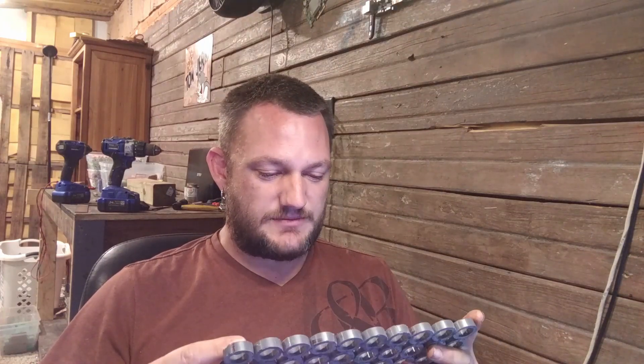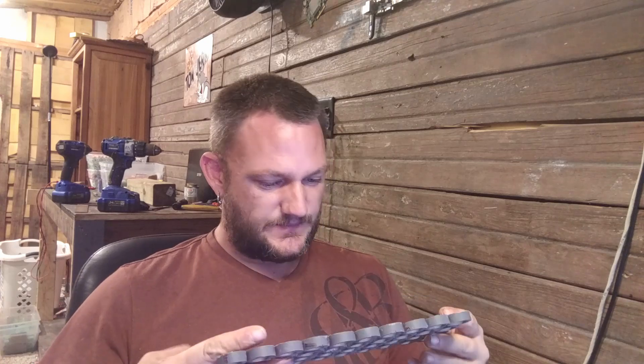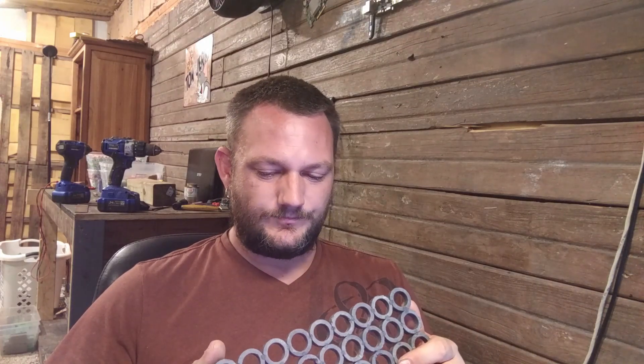Overall quality sucks. Maybe if I'm in a pinch this would be great, or if I was going to have high amp draw it might be something to look into. But I think I only want to use about 325 to 333 milliamp draw per cell, so it's not going to be heating up the cells. Concept is great, but the practicality of making these just isn't there - especially with the price of pre-made 18650 cell holders. Like I said, you can get 20 for less than $11, and you're going to end up spending a lot more making these.